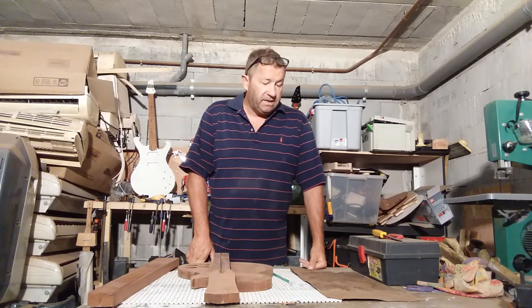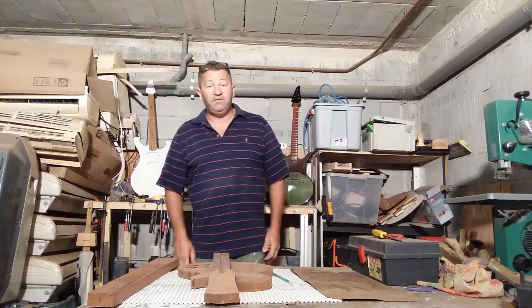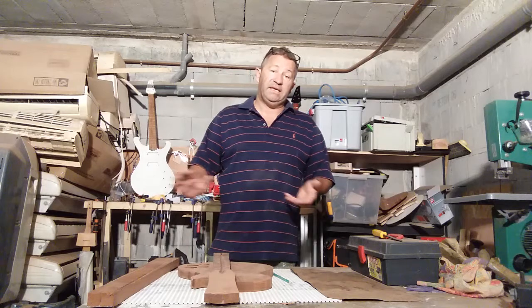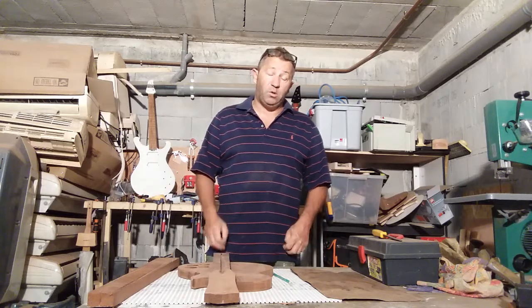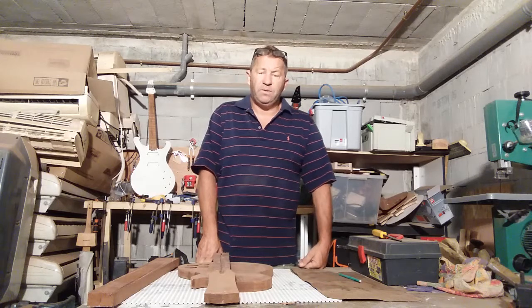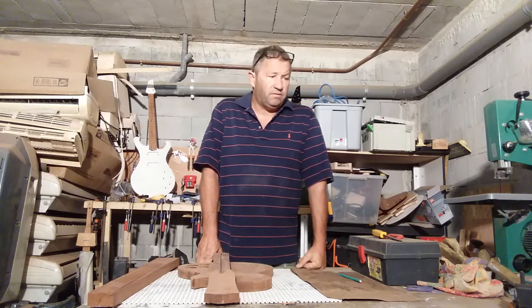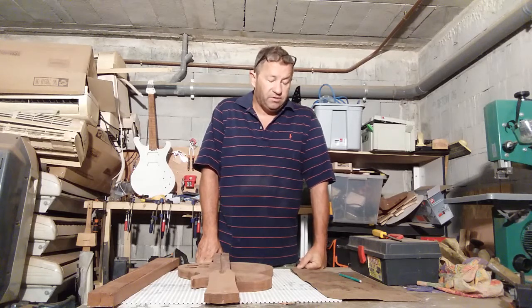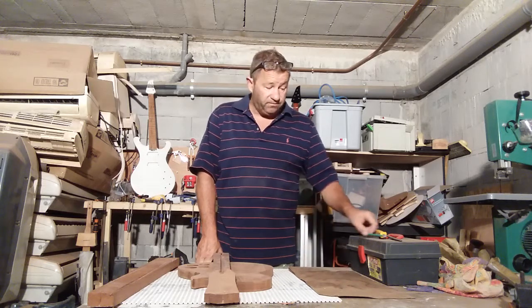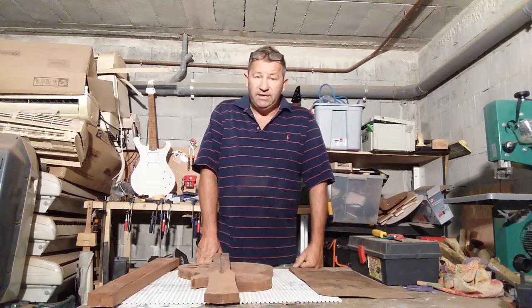Ebony — let's talk about ebony for a minute. We used to use a lot of ebony fingerboards. It's very brittle. Normally before you glue it, it's a good idea to wipe it with alcohol because it's quite oily. Things have changed from when I made guitars 30 years ago. Rosewood is getting difficult to get hold of from certain countries — we just used the best wood back then; it wasn't endangered like it is now.